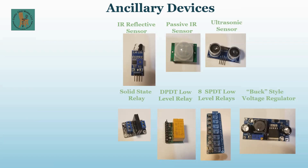And the size of this thing is, I don't know if you remember seeing it in the last one, about 1.25 inches long and a little over 1/2 inch wide. If you put a bridge rectifier on the input, you can actually use AC on it, and there's a little capacitor here that smooths it out and makes it quite usable. I have a YouTube video on just this device and ways to use it, so we'll cover that later.